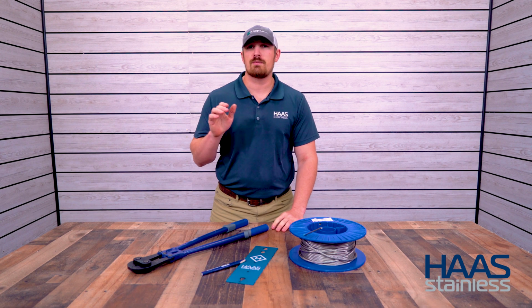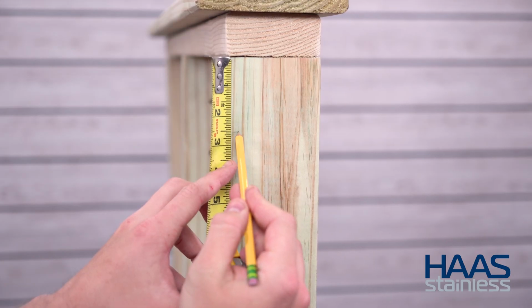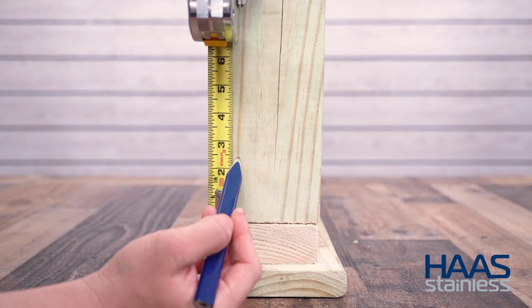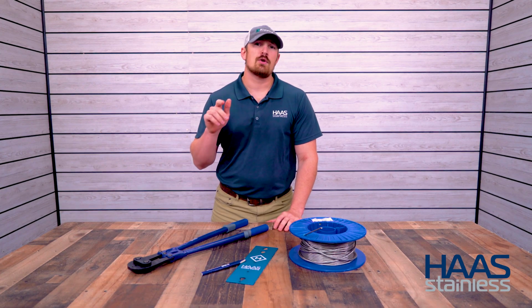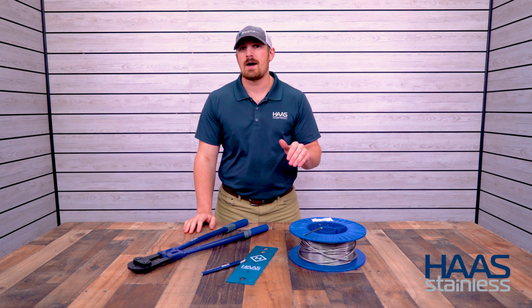So to start using your marking template, the first thing that you need to do is measure and mark your top and bottom gap on your post so that each row of cable can be equally spaced 3 inches apart in between the 2 marks. And if you're not sure how to find the top and bottom gap, no problem. You can click on the link in the description below, which will bring you straight to E-Rigging.com, where we'll show you how.